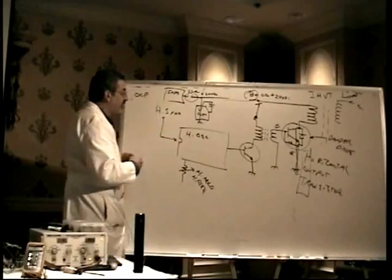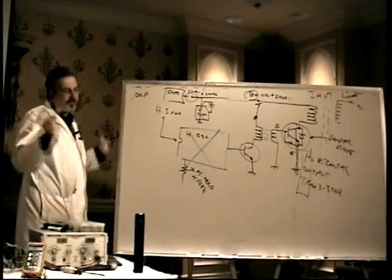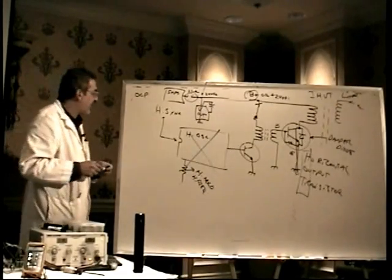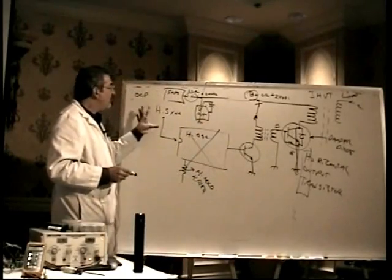X-ray protection shuts off the horizontal oscillator, actually. I can tell you now. I couldn't tell you before. What the X-ray protector actually does is shut off the oscillator. And I'm actually not going to cover it. It's in the book if you're interested. But as long as you know that it exists, that's all I care about. And, of course, if the oscillator's dead, there's no high voltage.